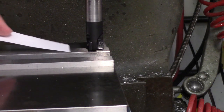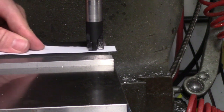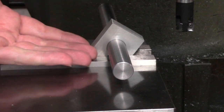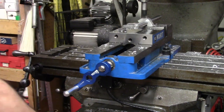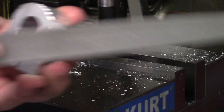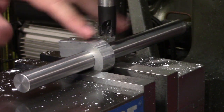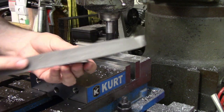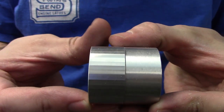To set the radius, you first have to find the jaw of the vise. I'm using the paper trick again because I don't want to actually touch the vise jaws with my cutter. Once the paper grabs, I know I'm the thickness of the paper above the jaw. To make the cut, I need to lower the table so my cutter is the radius of the part plus the radius of the pivot pin above the jaws. Make as many or as few cuts as you want — this could be done on a rotary table or CNC machine as well, but the technique I used requires no special tooling and minimal setup. You'll have to deburr the part at some point to allow it to continue pivoting. Just make sure you don't swing it around too much — if you let the sides of the part go past horizontal, you'll start cutting into the body of the part. Once the cut is done, you're left with a radius that has a lot of facets, which are easily smoothed out with a file or a belt sander. After about five minutes with the file, the result really did not take much effort at all.